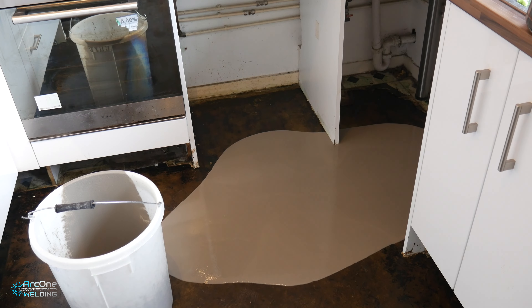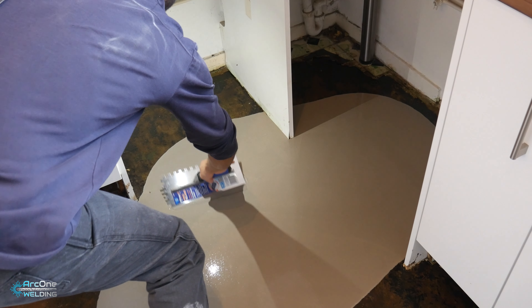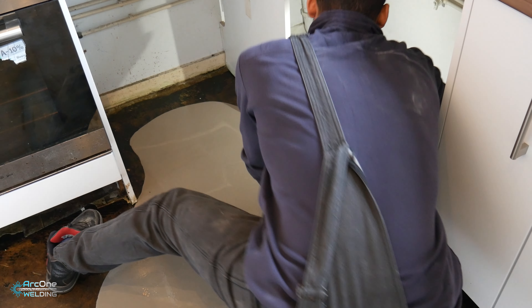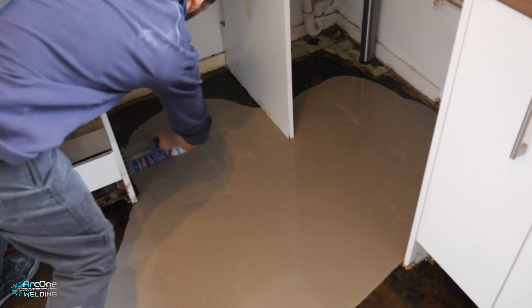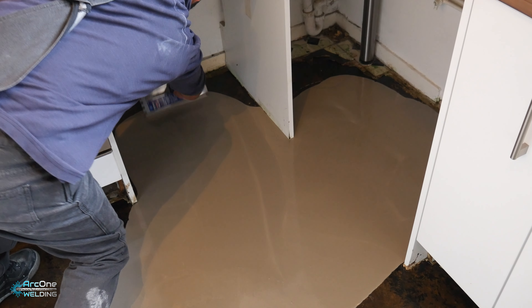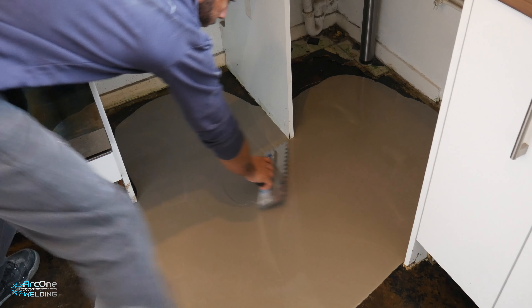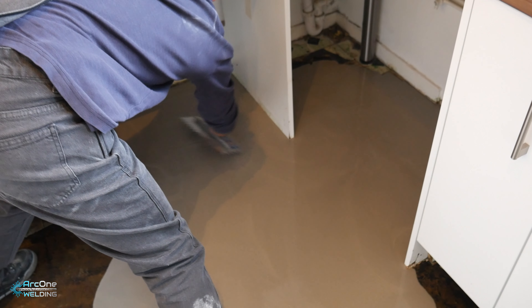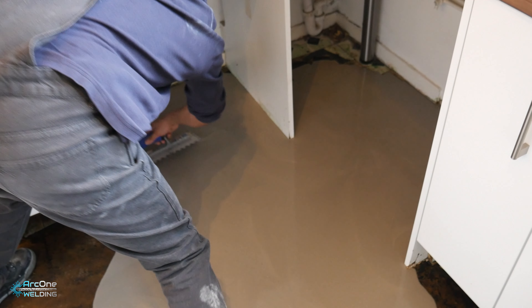Once that was up, I cleaned off all the glue — I used litres of hot water, degreaser, soap, everything. I scrubbed my floor, used a wet vac to clean it up. After I got it done nice and clean, I put down some primer so this acrylic floor leveler would stick to it nicely. That's when I'm spreading it out now.